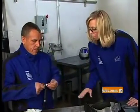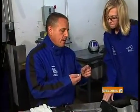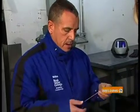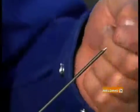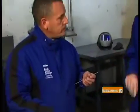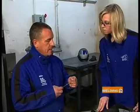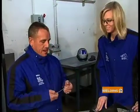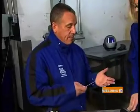Any tips on sharpening the tungsten? Taper it back approximately two to three times the diameter of the tungsten itself — about the same as your stick-out. When grinding, use a grinding stone and make sure the grinding marks go in line with the tungsten, not around it. What happens if you touch the tungsten to the base metal? It's instantly contaminated — the base metal collects on the tungsten. As a beginner that happens quite frequently, but when it does, you need to stop and re-sharpen it.